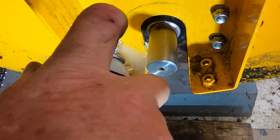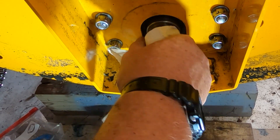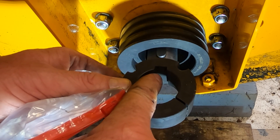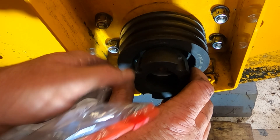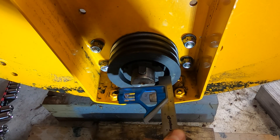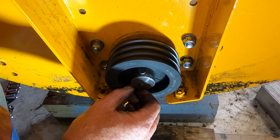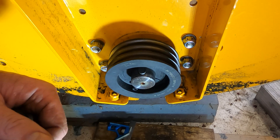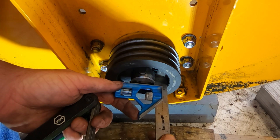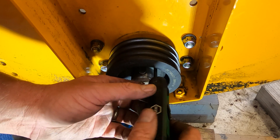Now that we got the bearing carriers bolted in, the next step is to put the pulley on. Use some brake cleaner and make sure you clean up the shaft real good — you don't want any gunk on there. You want to make sure the key sits in there without any problems. Slide the pulley on, then slide the bushing on, and make sure you line up the machined groove with the bushing and the key on the inside. Give it a little wiggle and it should slide right on in there. Now take your square and set the depth — you want to make sure you get this right, otherwise the upper and lower pulleys won't be aligned and you may have problems with the V-belt. Once you get it measured out, put your two set screws in. Keep checking as you tighten those set screws because it's going to pull the inner bushing a little bit. You just have to play with it. These don't have to be gorilla tight — just get them in there and give them a good nudge.